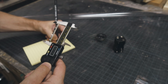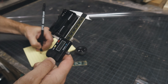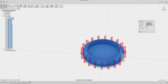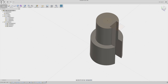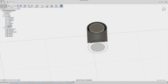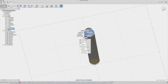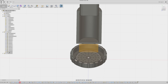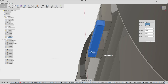The idea was to 3D model and print the hilt. To do that, I had to measure all of the things that were going to go on the inside of it with some digital calipers. I got all the different measurements for all the different components and then moved into Fusion 360 to model it. The entire modeling process took several hours. I made really simple geometric models of all the components that needed to go on the inside, then started with a basic cylinder and made embellishments on the outside to add details — I was really just making those up as I went along. I'm not a pro at 3D modeling at all. I'm figuring it out as I go, and if I can do it, you can do it too.